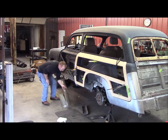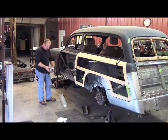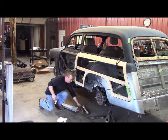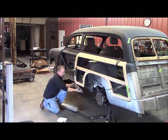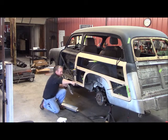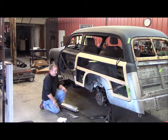I have these rocker panels — this is off of a car, and it's shorter. I've got to have a radius, a football shape from here to there, and then blend into this piece which is a little straight. So I'm going to have to shrink this and put just a little bit of radius in it, then come up with the number of where it's going to lean. I don't know what the lean is supposed to be that'll look good and translate over into there. The other side is completely wrecked and gone, so it's pretty much up in the air. That's what I'm up against.